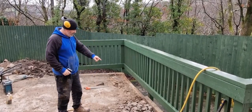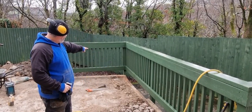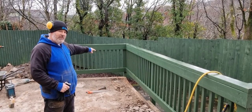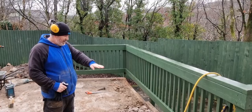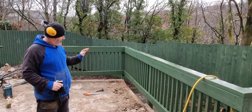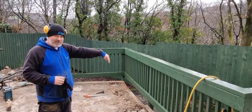In order for me to do that, the brickwork that's already here is out of level. We're going to have to put a string line to get the level when I transfer it. And then we're going to have to cut individual blocks and bricks to make it level on top of the existing brickwork. Customer knows about it. Nobody ever goes out there. She's not really bothered about the appearance of it outside there.